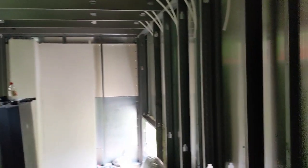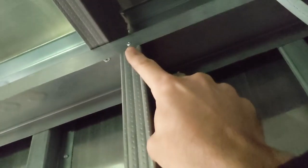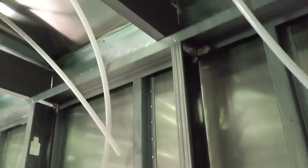I've got a good amount of interior framing done. Just like on the doors, this is standard metal stud style construction — there's a track laid down on the floor and a track up at the top, and the steel studs slide in there. Since I can't get to the backside, I put construction adhesive back there and a rivet on the front side. The same is true for the roof joists — track on either side, studs slot into it, and rivets underneath to secure everything.